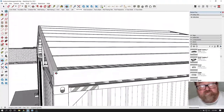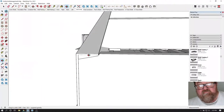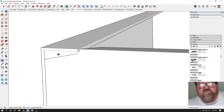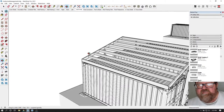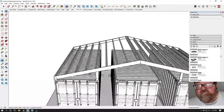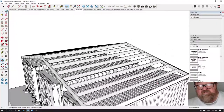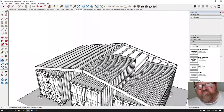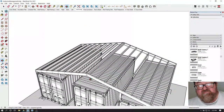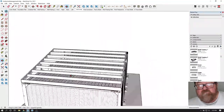And then you can tell the difference between a cold rolled shape and a hot formed shape. The more structural shape is on the ends. These rafters are carrying the load. Okay, these purlins are carrying what we consider a tributary load. They're only carrying that zone of the load. So they're lighter weight steel, but there's more of them. There's 14 of these versus 4 of these other ones. So it's all in the math.